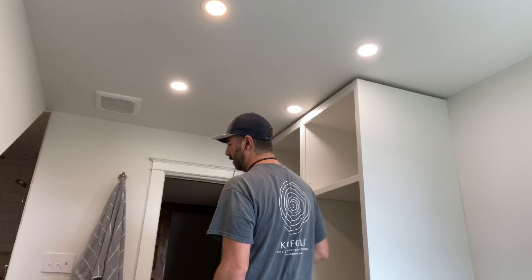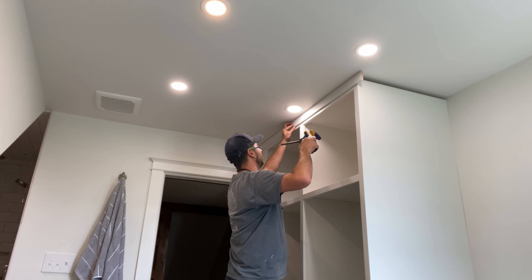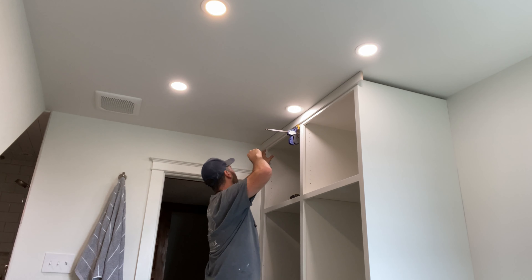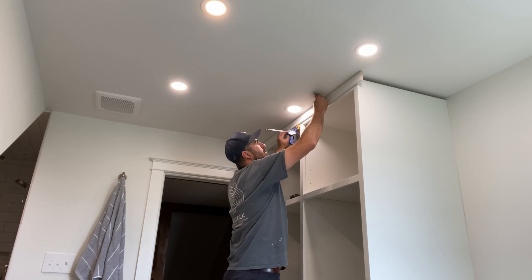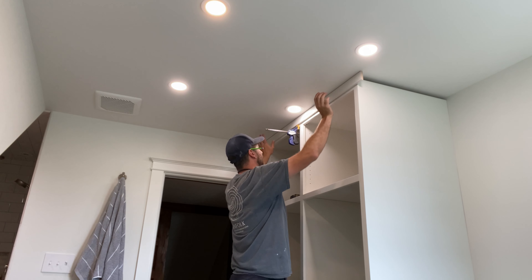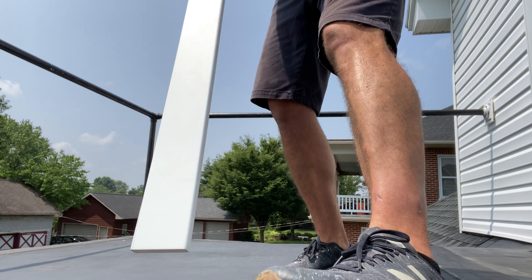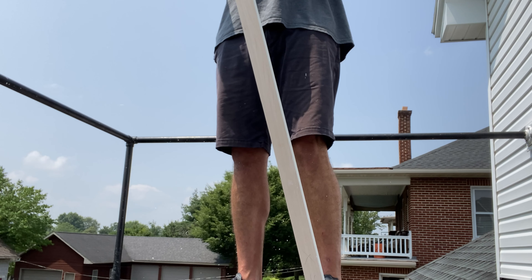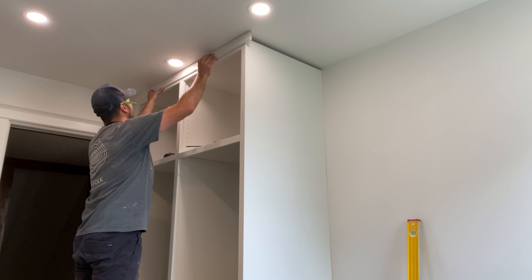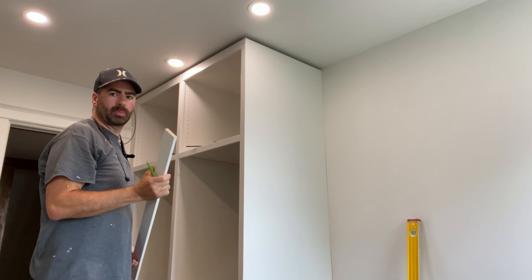On to the last little bit here — the trim along the top. I'm going to clamp this along here because the ceiling isn't perfect. Make sure I have the same reveal on my face frame. I'm just going to scribe it along the top. There's kind of a hump right here at this light. I cut this piece a little long so I can scribe it without messing with the miter — I can get it scribed into the ceiling, then mark the short point, cut it, and it'll be good. There's a balcony out here I'm going to do it on. I'm back in it — that fits much better. Good clean mark on the back, that's my short point.